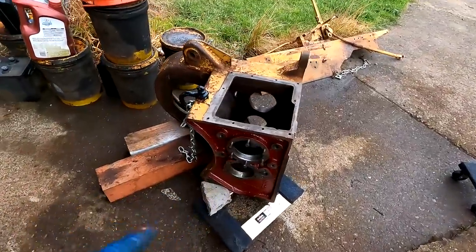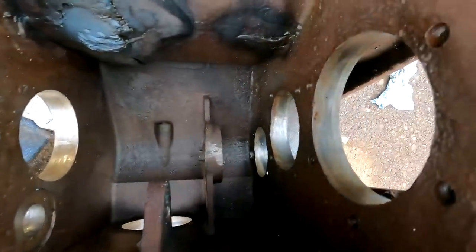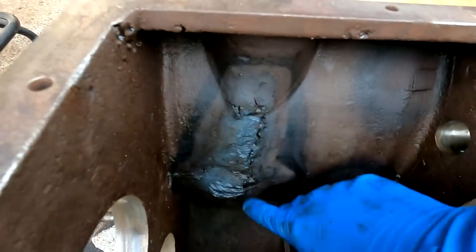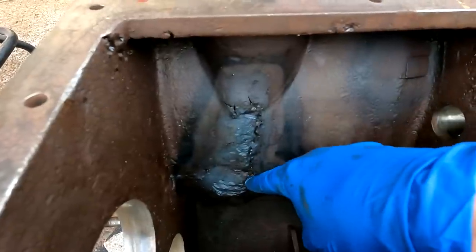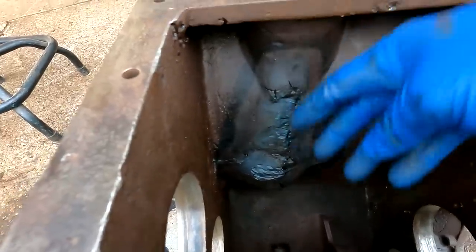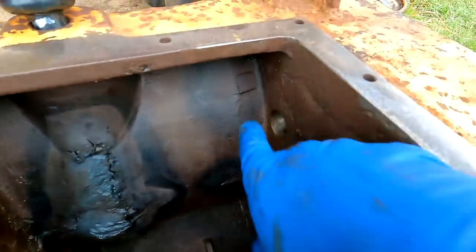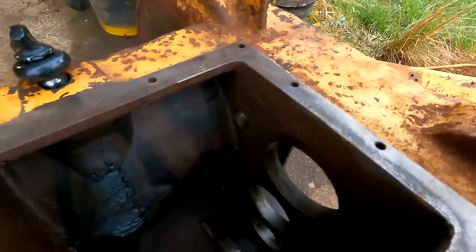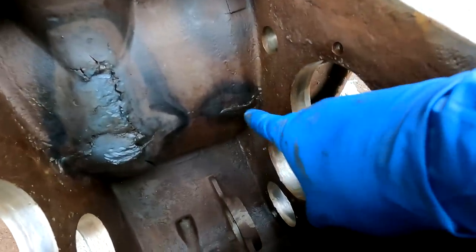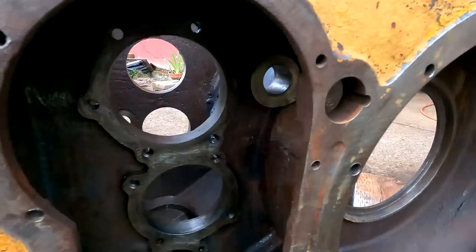On the big casting here, I already painted that side — this is like the side you're never going to see because it's up against the other one. In here it's really clean, it's ready for paint right now. But you can see this crack. There was a lot of slag and other junk in here and it was just falling out. So I spent a lot of time chiseling on it with the scaler, then just wiping it down and making sure nothing else came out of here. Hopefully I'm going to put on a bunch of different coats of Glyptol to hopefully seal that up. You can also see maybe there's a repair there, and potentially other repairs there — that could just be a cut down for the first assembly. Coat number one is done. I'll come through and touch up any areas that I missed.